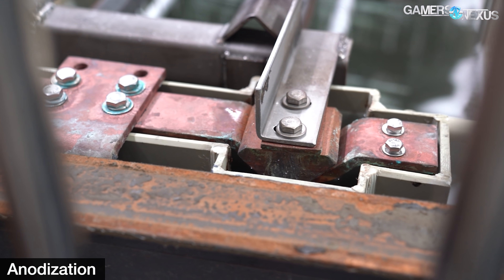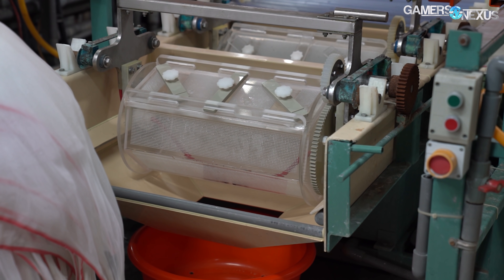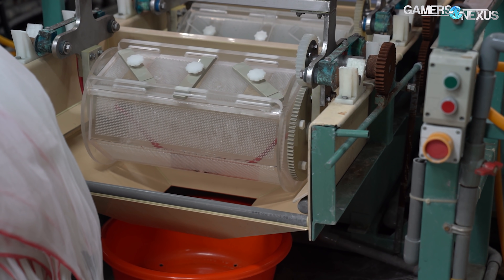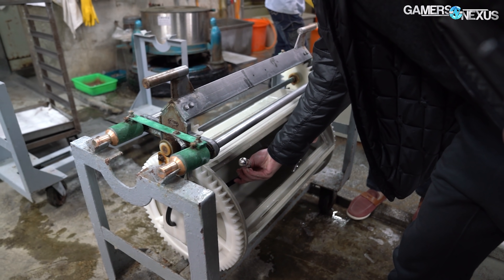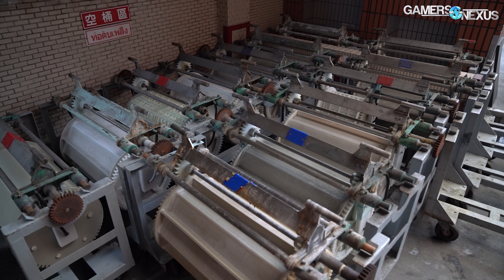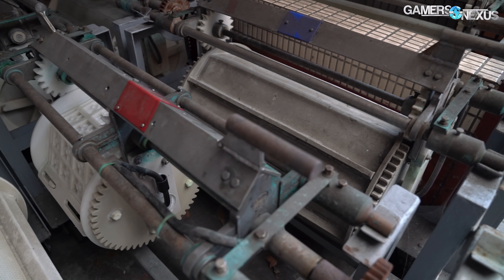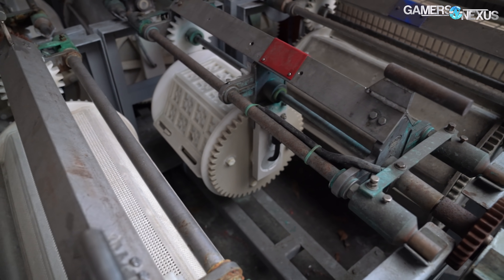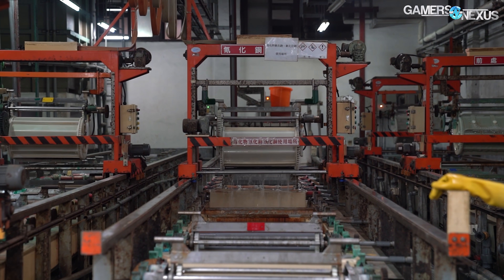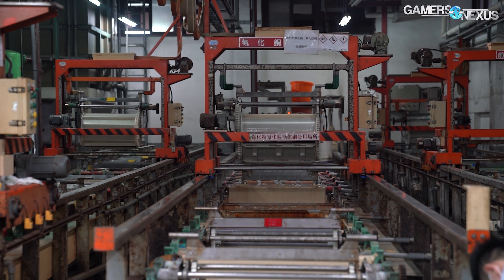Each barrel has its own metal frame with contact points and a cog to interface with the crane. The tumbling action isn't constant — the crane must occasionally move over, lift up a barrel, spin it, and drop it back down. Inside the barrel are thick electrical cables with bare copper contacts on the end that roll around and maintain contact with the items being plated. Barrels with bigger holes are more efficient and have less impedance for water moving in and out, but smaller holes are necessary to keep parts from falling out or getting stuck. Applying a layer of plating in a barrel takes 30 minutes, but some coatings are multi-layered — nickel plating, for example, often uses a copper base coat, so the process takes an hour total.